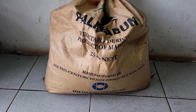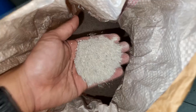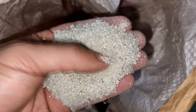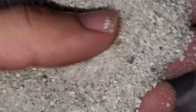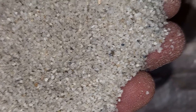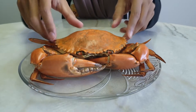So what media do you actually fill inside the sand filter? We are using sand with a grain size of 0.6 to 1.2 mm. You need to refer to your manufacturer's specs and decide what is best for you. We are using river sand, and we do not add anything else such as carbon filter media, because this is solely a solid removal process.